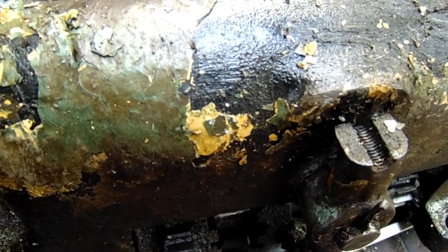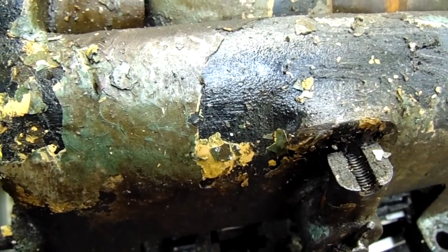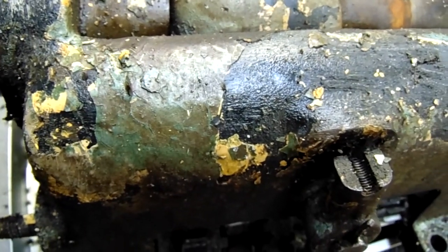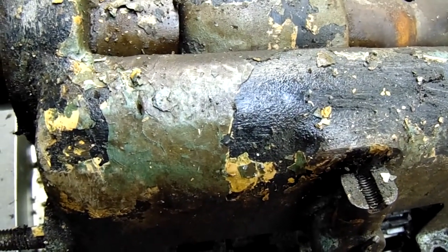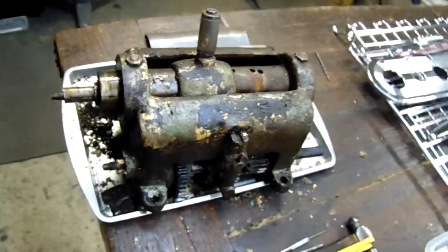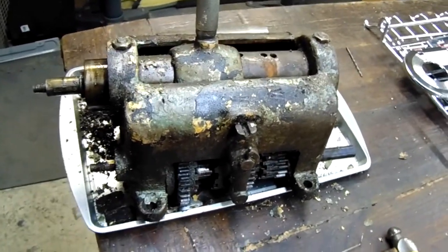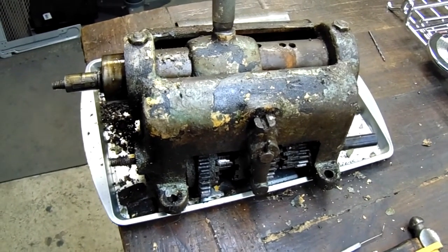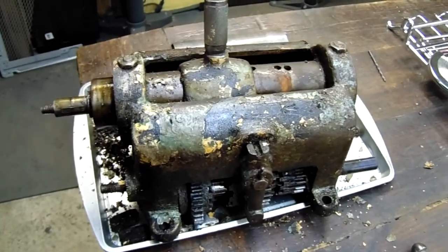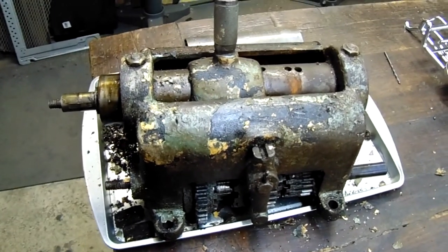You see there's some yellow paint there. Over the years working on these machines, I've noticed that a lot of times if a school got a hold of a machine, they would paint a lot of mechanisms safety yellow, just for their insurance purposes and to keep people safe. Since it's so greasy, we're going to submerge this whole unit in an industrial degreaser and just let it soak for a while so we can get rid of a lot of this before we do our deep cleaning.